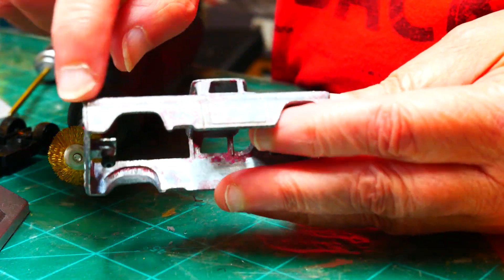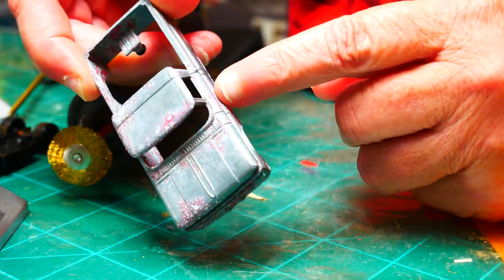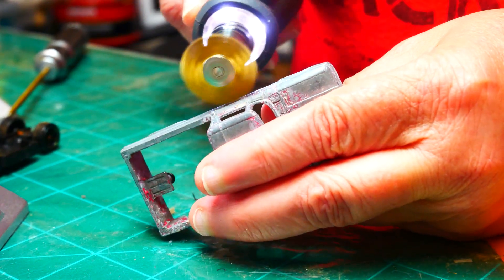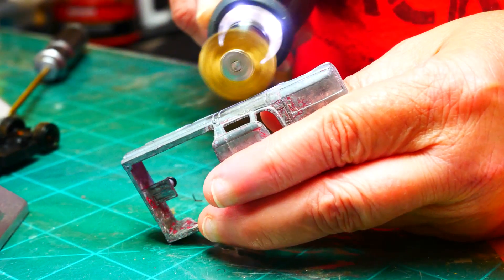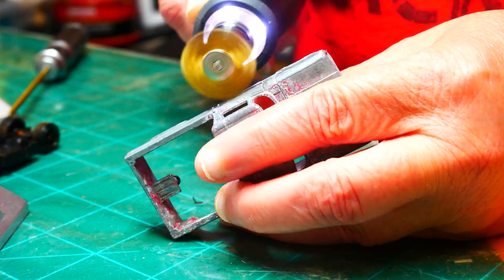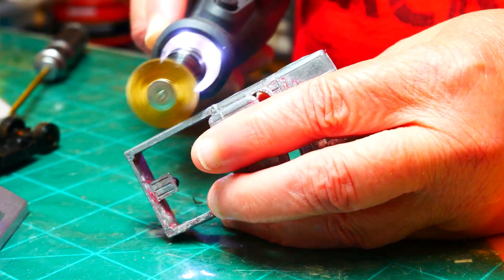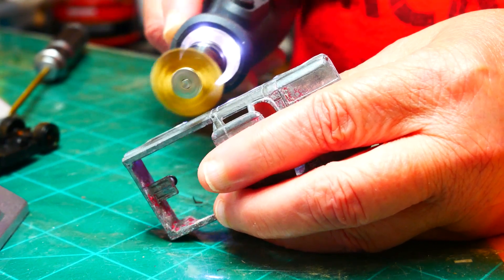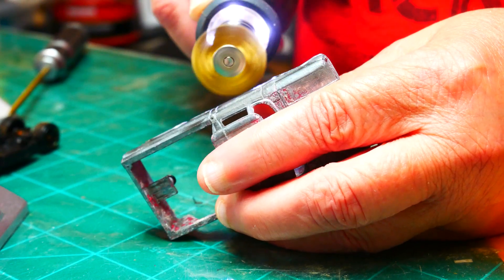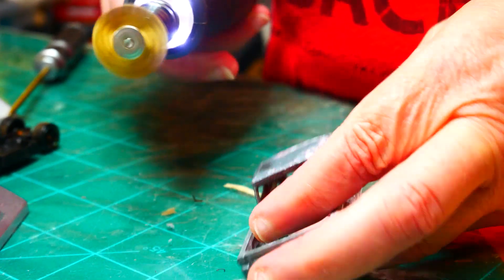The citrus strip didn't take everything off, but the corrosion was making the paint adhere. So we're going to take a wire wheel in my Dremel and clean it up as best we can. The wire wheel is taking off the corrosion and paint. I'm probably going to have to come back with some sandpaper and maybe some dental picks to clean out the grooves. There's a lot of paint on the inside still left, but I'll go over that real good with the wire wheel.